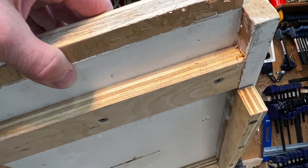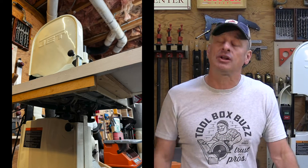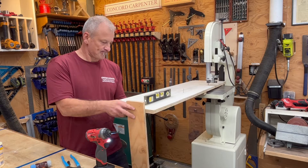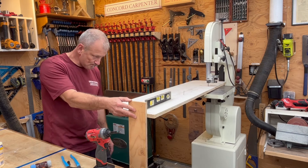That index stop kept everything aligned, and then I installed some scrap plywood pieces underneath with screws to become like under-clamps — stability supports that kept the fence from moving and locked it in place without needing clamps. There's also a hole in the top of my saw where I could put a screw through, and a clamp could prevent the table from lifting as well.